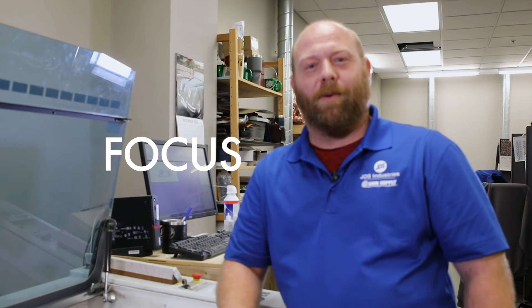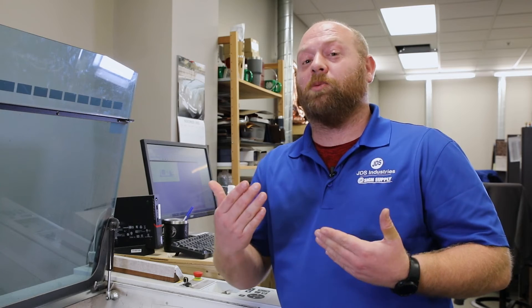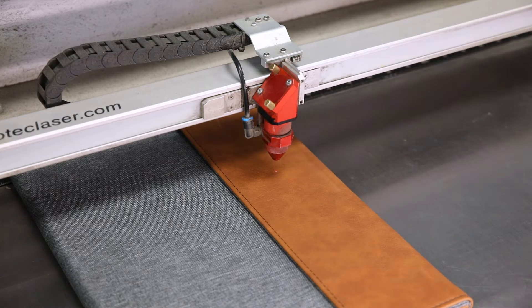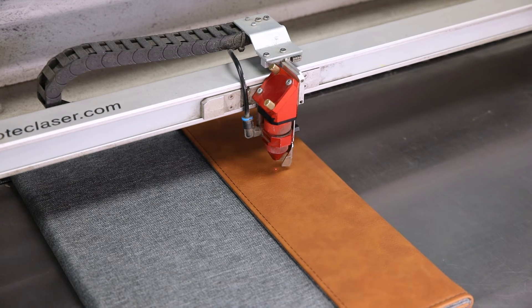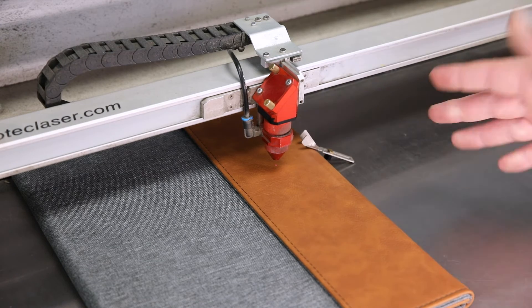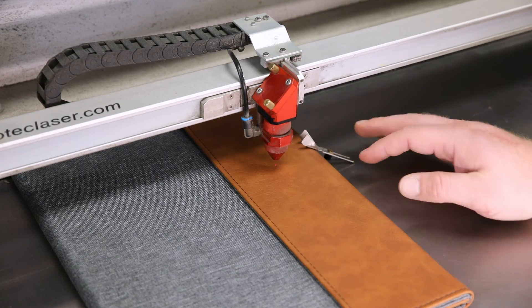The last term that we're going to cover is focus — a little out of focus here, hang on. Focus is basically the distance between your laser head and the product that you're lasering. Here's an example. Different lasers have a different way of focusing. With this one, we hang our dongle on the laser head and then we raise and lower the laser bed in order to get the proper distance for the focus. That dongle's fallen off, so now I know that I am properly focused on this item.